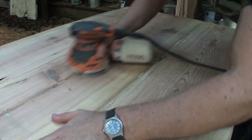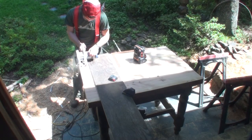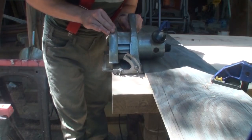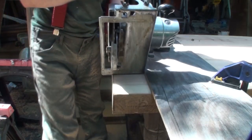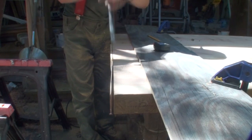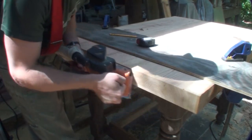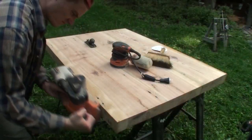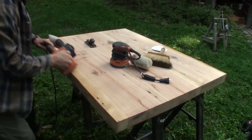While it was drying I went ahead and smoothed up that wood filler and gave the top its initial sanding. While the biscuits do help align the faces of the boards, the ends shift sometimes, so I marked out a straight line, set up a fence out of plywood, and cut along the edge with a circular saw with a nice sharp new blade. The blade won't cut all the way through, so I have to finish the cut with my Japanese saw. Then using a belt sander I go back in and smooth that cut up, starting with rough grit sandpaper and working up to about 180.